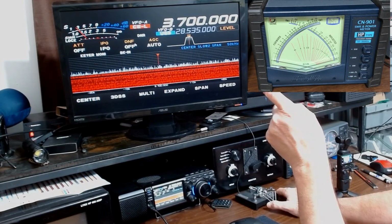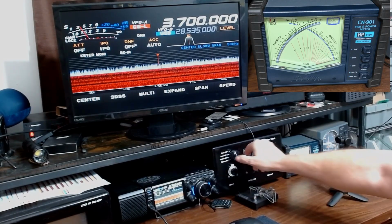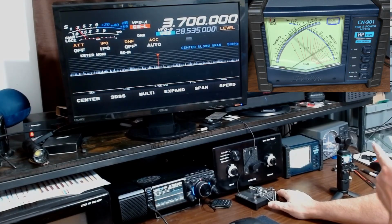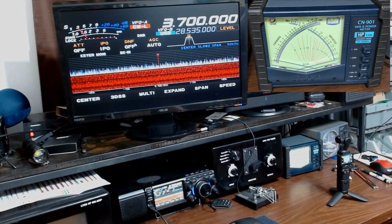And that's exactly what we're seeing. My radio sends power to the antenna tuner and nothing comes back from the antenna tuner. There's no reflected power. There's no standing wave. There's standing wave on the coax and the antenna, but there is none at my radio. Let me turn it back to bypass. What happens? The same thing over here, except my power goes down a little. But over here, now I'm seeing SWR on my radio.